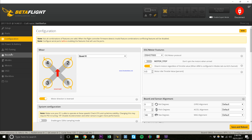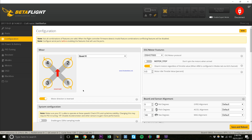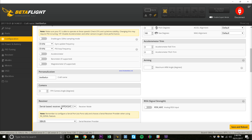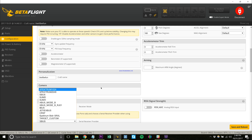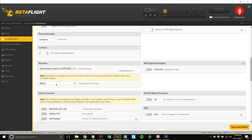If you are running a FrSky receiver, it's going to already be set up for your FrSky receiver. If you're running Spektrum, you have to go in here and change the Spektrum setting — I believe that's the setting you'll need to change right there and it should work. If it doesn't, go Google it or jump in the Needle Frames Facebook group — I'm sure there's somebody running Spektrum who can help you out.